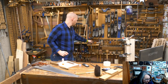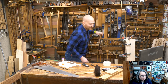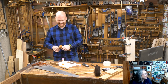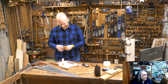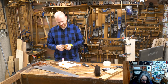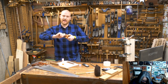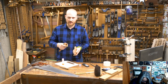Steve Does Stuff sent a super chat — thank you, man! He says now you don't have to use grass-based materials. Yeah, is a palm tree grass? I don't know. So I'm going to set this at a half inch for the scales plus a sixteenth inch, which means I'm setting my marking gauge at nine-sixteenths. I'm going to mark this off while Sarah gives us a mom joke.